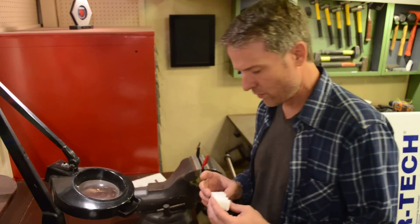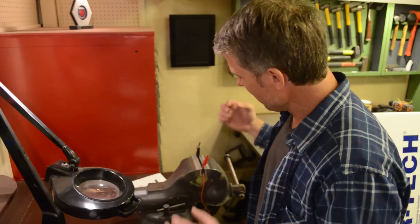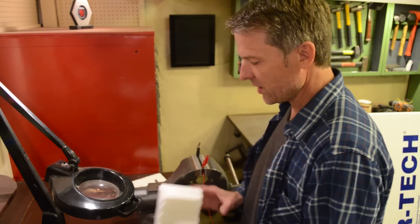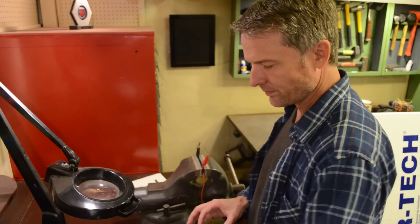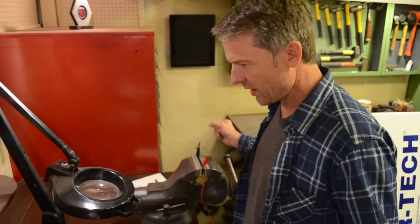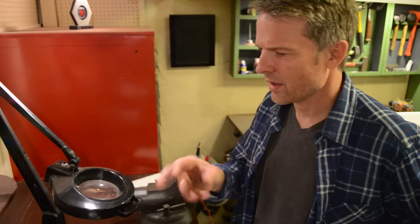Not sure how bad the fumes are for me. But the idea is to take this basic idea — other people have done it — and stretch it out to a 60 or 70 inch wire in order to cut a wing made out of a fairly thick piece of this foam. This was my first little baby step into figuring out how to do it. I'll have to see with a longer wire if the little wall adapter is up to the task. Other people use battery chargers or model train transformers since they have a dial-type rheostat built in.